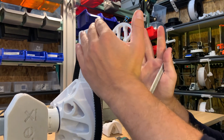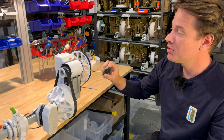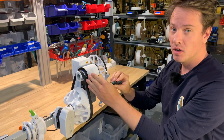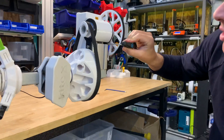Let's move this one up — and there are a few tricks and things you should be aware of. The first thing is we want to make sure that we don't tilt this top shaft up here. What I like to do is have about eight millimeters of clearance in here.